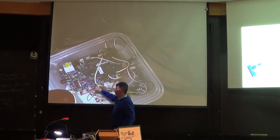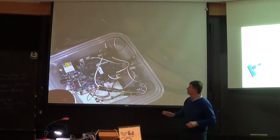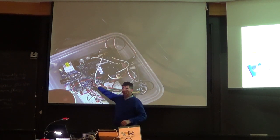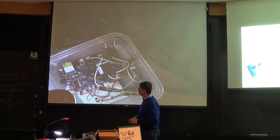So you've got the Galileo, and at the root of it, it's a Linux board. It's similar in a lot of respects to the BeagleBone in the sense that you can run a variant of Linux, although this is an x86 instruction set, whereas the BeagleBone Black is an ARM instruction set. We could get into that if people are curious. At the heart of the Galileo board is this new Quark chip, which Intel recently announced. It's essentially x86 compatible, so it should run lots of stuff that people can already run. Certainly not as powerful, not as electricity hungry, but a very capable chip.